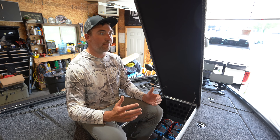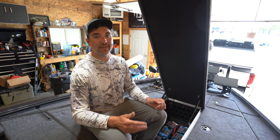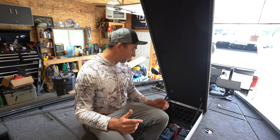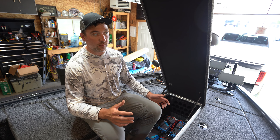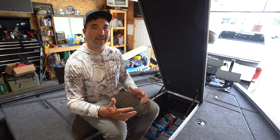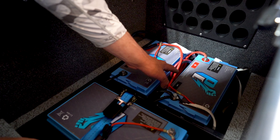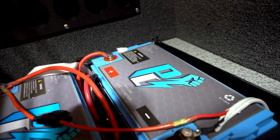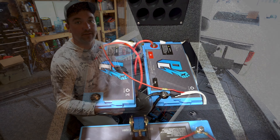They also come in 24-volts if you're running a 24-volt system. But because I'm fishing nationally and competitively, doing 16-hour days on the water in these big tournaments, I've actually got a second 36-volt battery just in case something happens to one, and just to give me that extra amperage. Probably overkill, but that's the setup - two 36-volt Powerhouse 40-amp batteries run parallel to each other, so it's still 36-volt, and they're tied into the trolling motor. There's actually a charging system that I'll get into in a little bit.